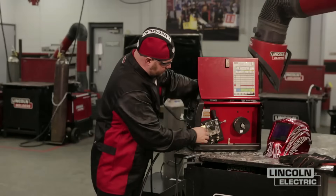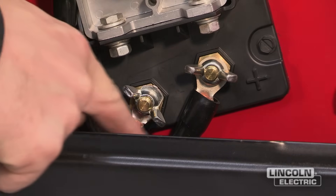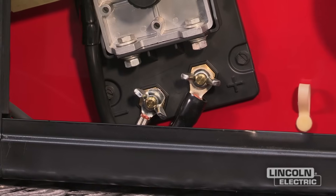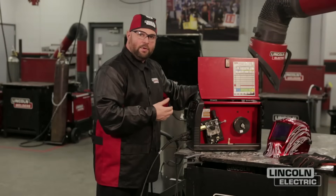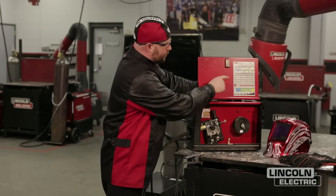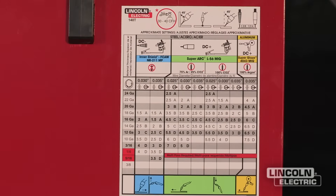Moving to the bottom area of the drive assembly, we've got two output studs for determining what polarity we're going to be welding on — a negative output stud and a positive output stud. The setup here is electrode positive for GMAW welding: the cable from our feeder is hooked to the positive stud and our work cable is hooked to the negative stud. For flux core self-shielded the polarity is DC negative, meaning the feeder cable is hooked to the negative and your work lead is on the positive stud. If you're not sure, the door on the machine will guide you to the correct polarity setup for the process you're using.